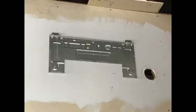When hanging the head itself, there is a mounting plate that you fasten to the wall, and there are a lot of screw holes and a lot of choices. And they've got a couple of them marked there for, it says SU, but it means US, the 16 inches apart. And that would typically hit a stud. And you do want to really screw it into a stud if at all possible, not those little drywall anchors. It's not going to hold.